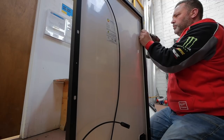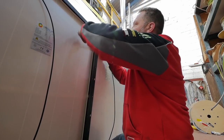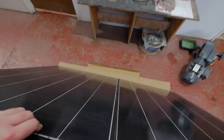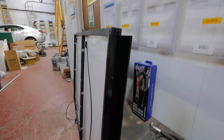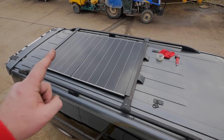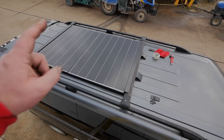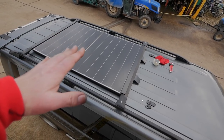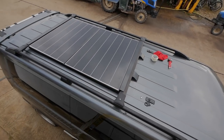First thing I want to do on this is measure down there and I'm going to drill three holes through to bolt these two panels together. There are the two panels bolted together — nice and sturdy — and there are some brackets I've bolted on, just made out of aluminium. I've sprayed them black. I'll just let that dry and then we'll go and try it on. There it is in place. I'm not going to bolt it down yet — I need to bolt it through those cross beams but I've left it all unplugged. You never plug in solar panels until you've finished all the wiring, because unless you want to work in the dark you can't turn those off — they always need to be the last thing plugged in. As you can see, this has covered up all that wiring a bit better — looks nice and neat.